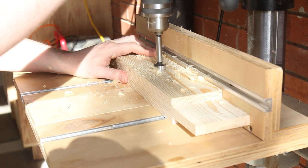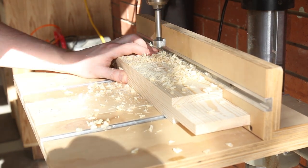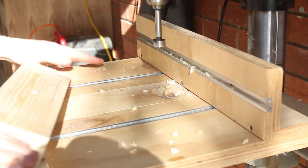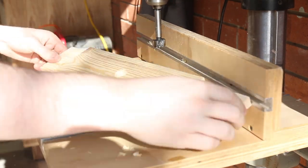For the shaft of the flip-top, the two top tenon members receive a 22mm bore centered horizontally and vertically. The drill press was set to stop just shy of going all the way through, so the workpiece was flipped and drilled from the other side to avoid tear-out.